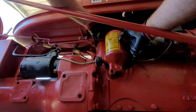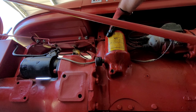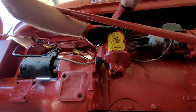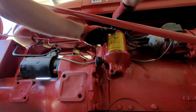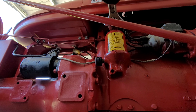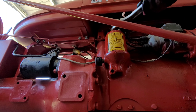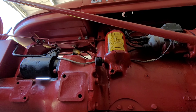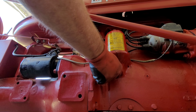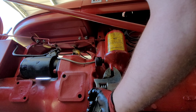Don't pull on the wires or tug on them. Make sure the sticker's out - be one of the cool kids. Line it up with the filter, hole in the filter, drop her down, and drive her home. Tighten it up about 90% of the way with your fingers, then use the thumb wrench to take it the rest of the way. It wasn't very tight before - I'm surprised I didn't have a bunch of leakage.